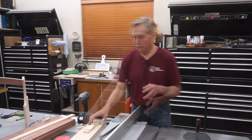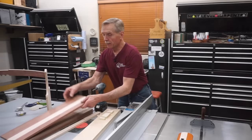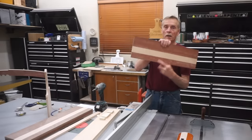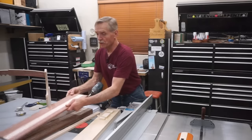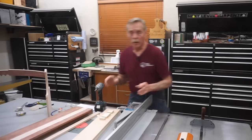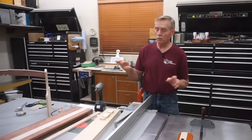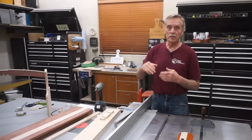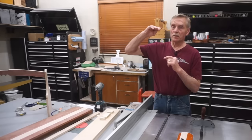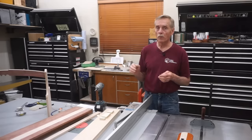And the trip down this rabbit trail is mostly necessary because I added this strip of a consistent width in an exact place on the sides, and I want the joinery for the box joints to line up perfectly with those strips. If your box side is just solid wood, you can just make box joints that fit nice. And if the side of the box doesn't come out exactly 6 7/8, if it's a little less or a little more, everything still works.